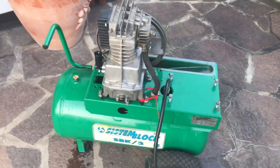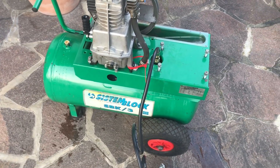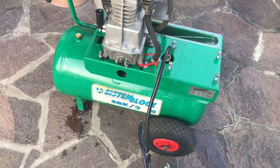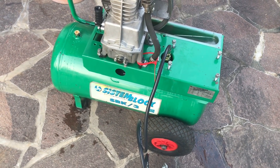So I hope this has helped you — a really quick and easy way to hydrostatic pressure test your compressor, make sure it's safe, then you know it's safe, you're not worried about it, and there's no chance it's going to blow up on you. This is sitting at 350 psi, so she's good at the moment.